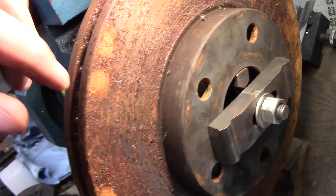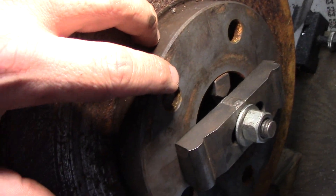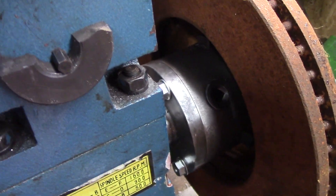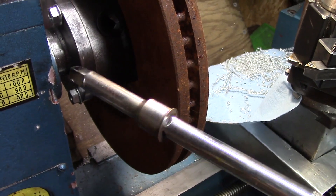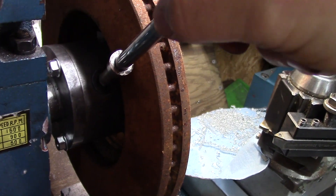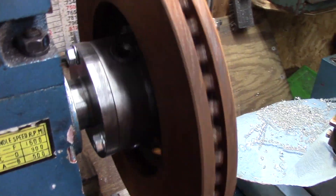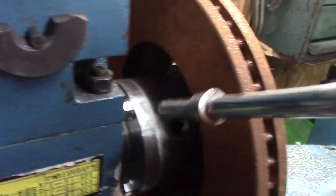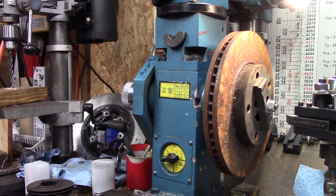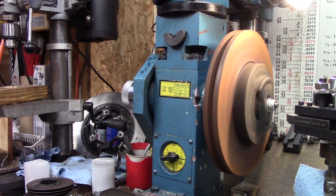I should mention that I intended to put this on the next set of staggered jaws, but the problem was I wasn't able to reach the nut to tighten the chuck down. I had to modify an old extension on a ratchet just to get down in there and tighten it up. Let's make sure that's tight and spin it up to see what it looks like. We are on the slowest setting.